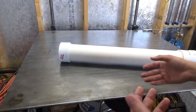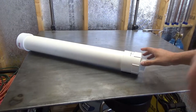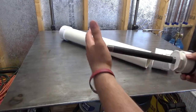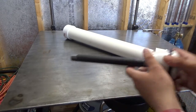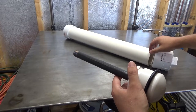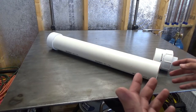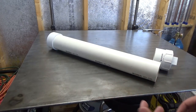This is going to have effectively three parts: the bottom of the cylinder, which is going to be open so you can put a can in and take it out after crushing; the top end where all the fun stuff happens — that's where the air inlet's going to be, all the springs and fun stuff; and then the piston, which will have a platen on it to actually do the crushing. We've got a couple fittings, some o-rings, and those o-rings will separate the bottom half of the cylinder — the atmospheric low-pressure side — from the high-pressure side. The side goal, other than making a pneumatic cylinder, is to do it all with things I could get at the hardware store — no special orders, no specialty stores.